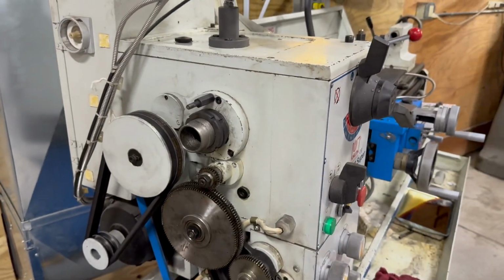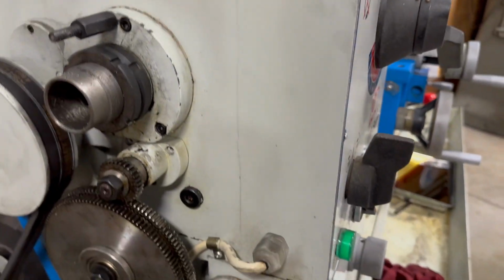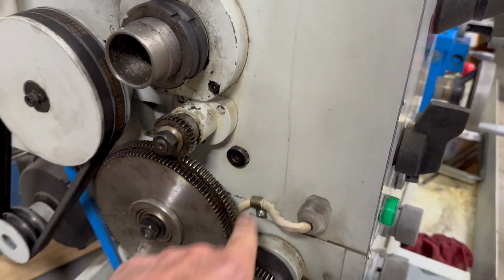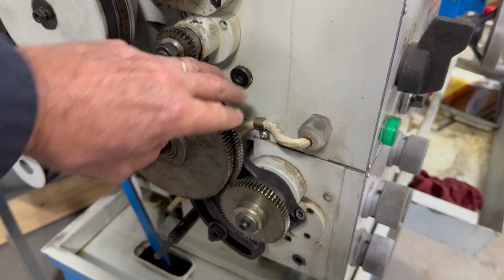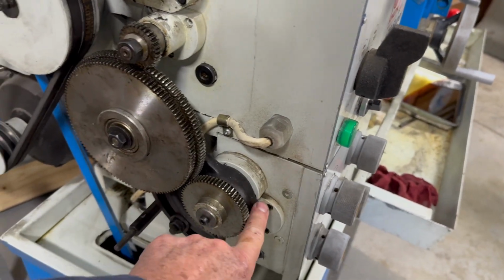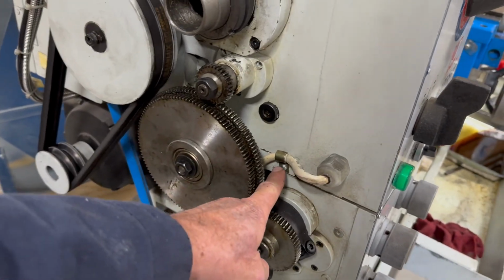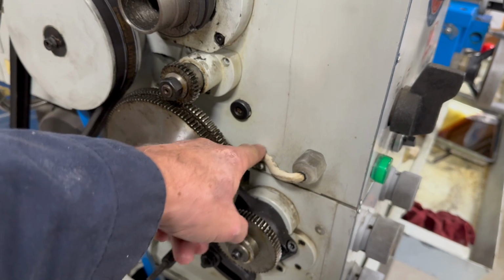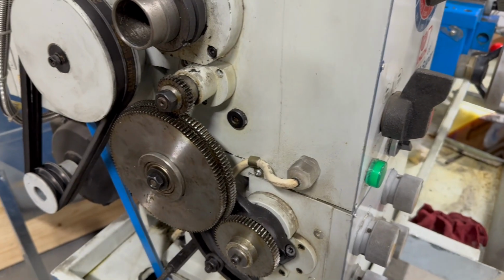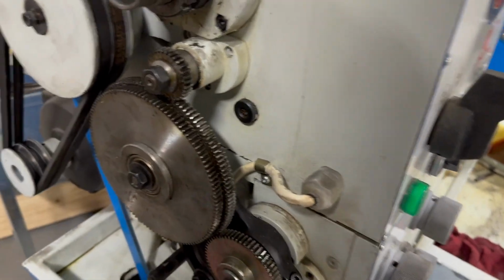This is the top gearbox. The top gearbox has a fill plug right here, has a drain plug right here. This is the 17mm, there's a 5mm, there's a 6mm, there's another 17mm. It takes the whole thing off. You can take this off so that it doesn't get basically covered with oil. Release the plug and put a pan underneath here.